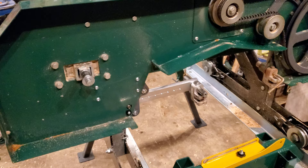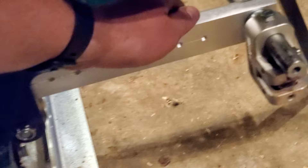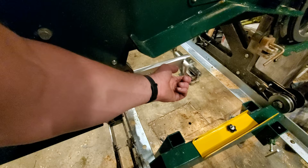We have the arm installed loosely. These four bolts — this little guy doesn't actually spin, but here are the adjustments we can reach and make if we needed to. It's still kind of in there loose, snugged up tight because we've got to get it to track straight. When we had the blade in, we could take some adjustment in with the bushings here, but we need this to track straight back and forth.